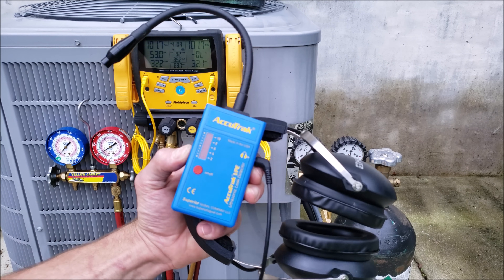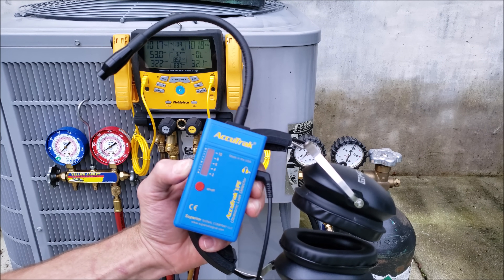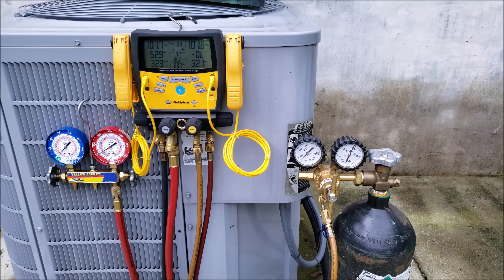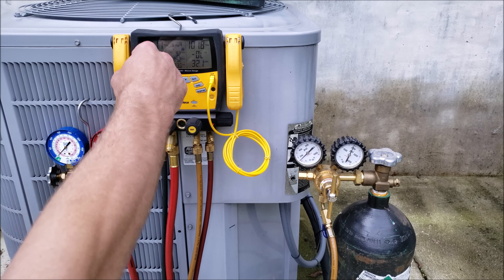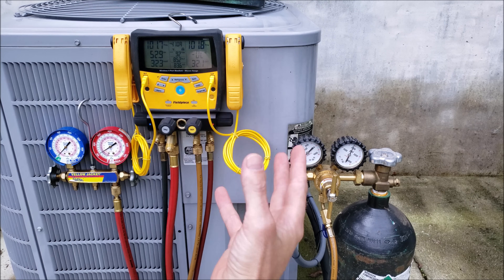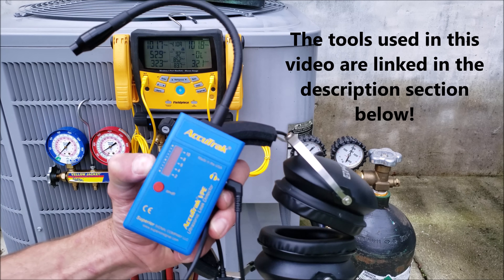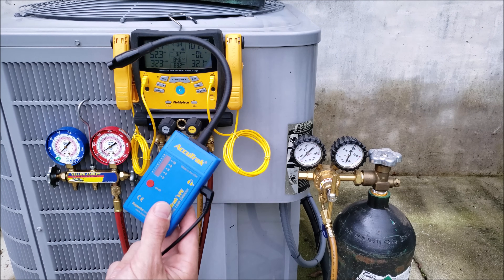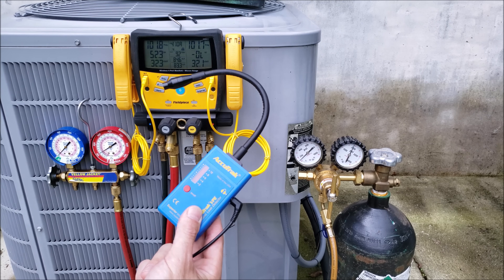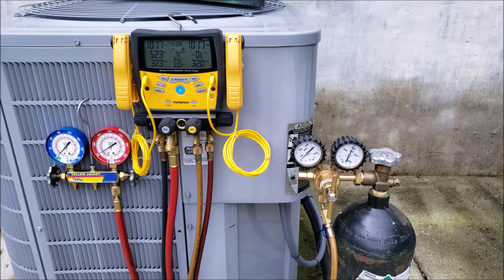If the leak is not in an obvious location, you may want to use an ultrasonic leak detector. You can listen for the nitrogen escaping through the tubing — it picks up the ultrasonic noise — and you don't have to release the pressure or add a small amount of refrigerant for an electronic sniffing tool. You can stop right where you're at, pull out the ultrasonic leak detector, and listen for the leak. It can even be used when it's windy outside. I have videos on searching for leaks with this tool linked in the description below.